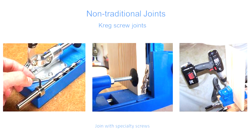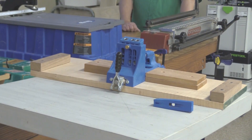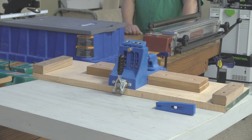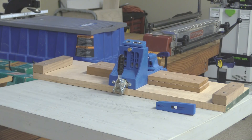The second picture shows almost a cutaway view — this is what the end of the drill bit looks like. You're drilling through, and the tip of that drill bit is not intended to poke all the way through; it stops just short of the surface of the end grain. Once you insert the screw and begin turning it, the screw will actually drive through that remaining piece of wood.